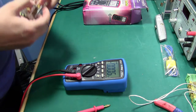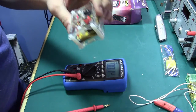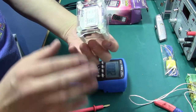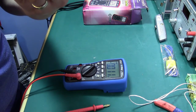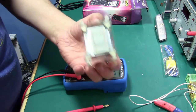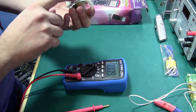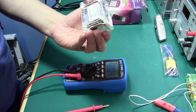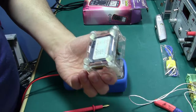Obviously the first thing to do is try it out with a voltage source. So I have a volt reference here from Heokizin — I have no idea if that's actually how you pronounce it. It was calibrated in November 2013 on an Agilent 34401A to 5 decimal points, so that would be 10 microvolt resolution on the 10 volt range at 21 degrees Celsius.